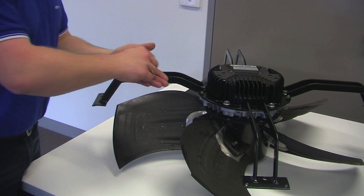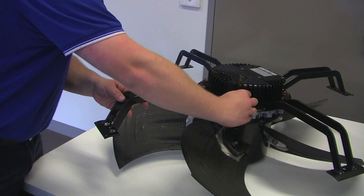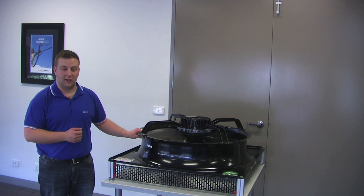It's at this point we take the opportunity to put the mounting pegs of the inner diffuser into the bracket. With all the screws and mounting pegs in place, we place the fan and bracket assembly back onto the wall plate.